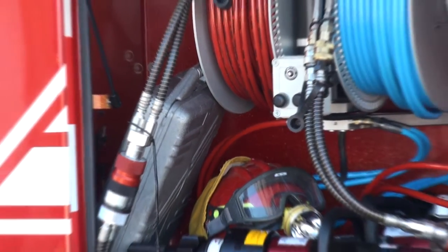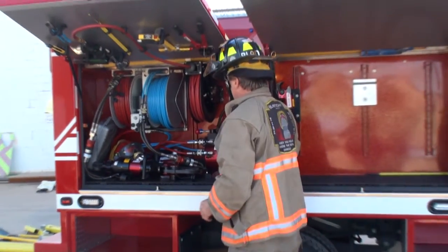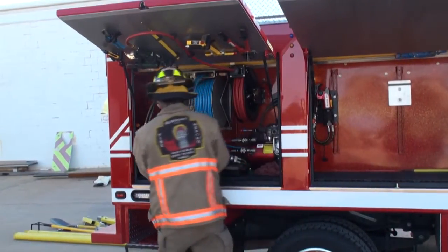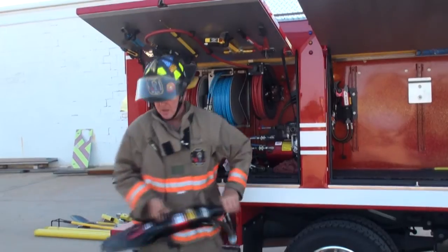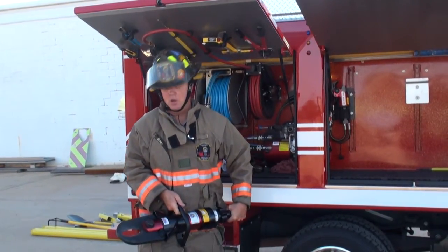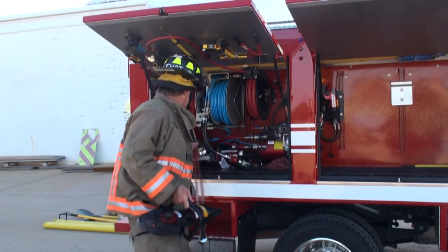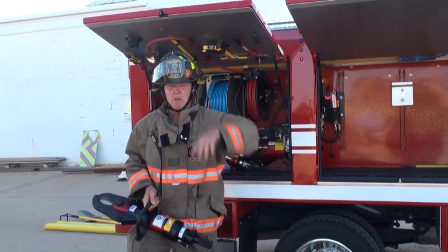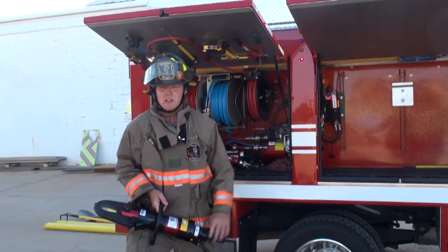Come up here and start the tool. I'll put it down to idle so you can hear me. I grab hold of this tool, pull it out, and I'm ready to operate immediately — I'm not hooking up my tool first. Also, when I pull it straight out, the hose has already been straightened; it isn't coiled. So you can pre-connect a set of tools in a compartment with a hundred feet of hose on each reel.